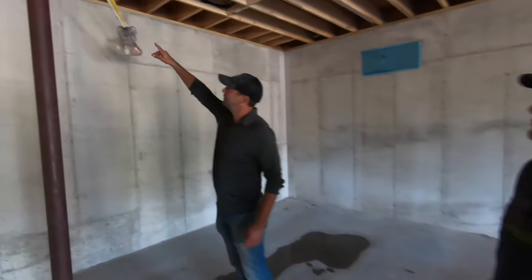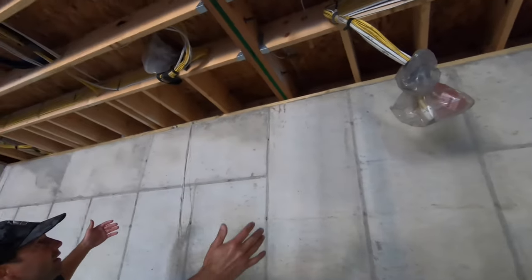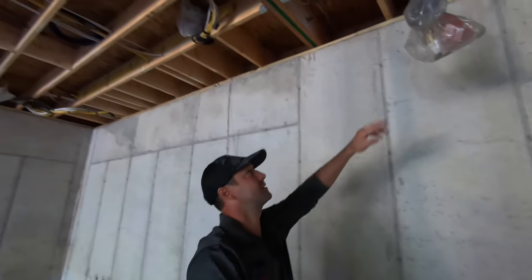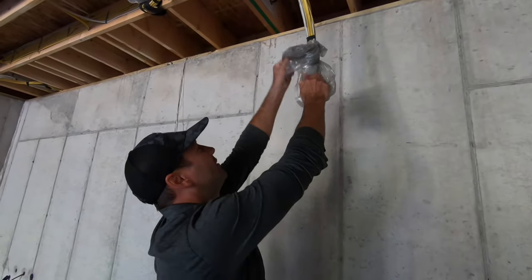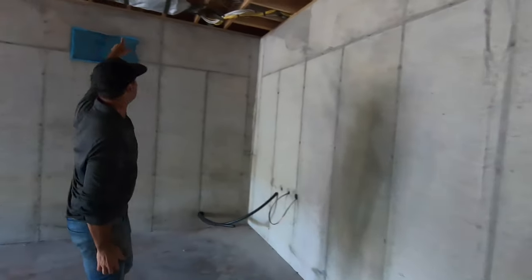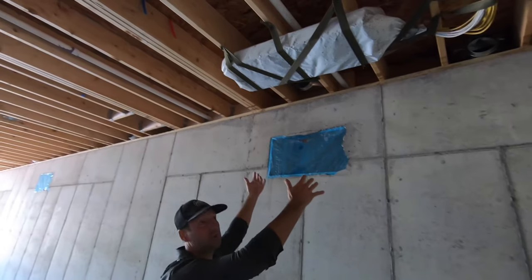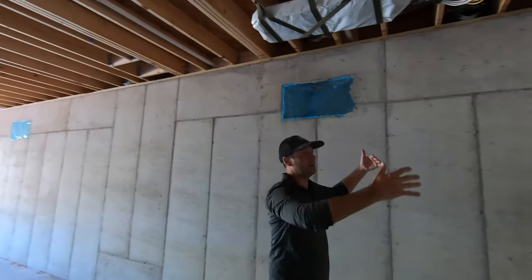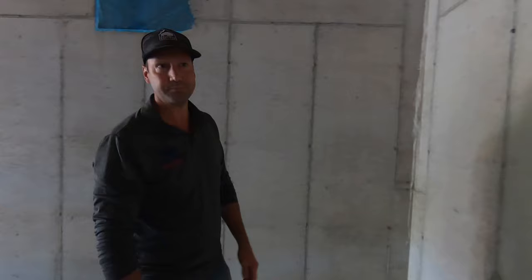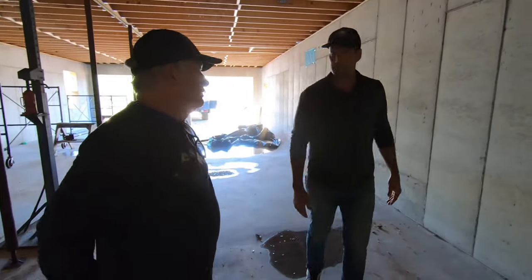Here are the electric connects — these are called the cross connects. You've got box A and box B, and your electrician opens these up and connects them. It's a plug-and-play unit. Seven goes into seven — a very straightforward plug-and-play process. This is your 200-amp breaker panel. Your electrician is going to cut these vinyl ties, shift it on the carrier, drop it down, and mount it against a plywood panel. Depending on where your furnace and water tank is, you'll collect them over there. It's going to be tankless water. Here's your grounding rod, and this is for your well.